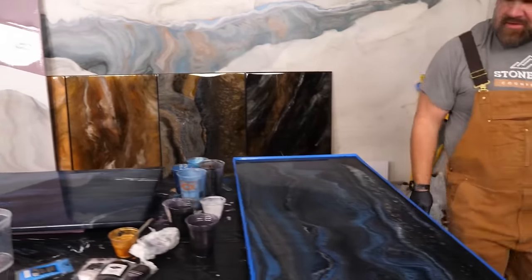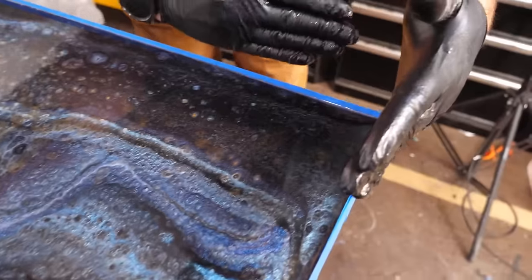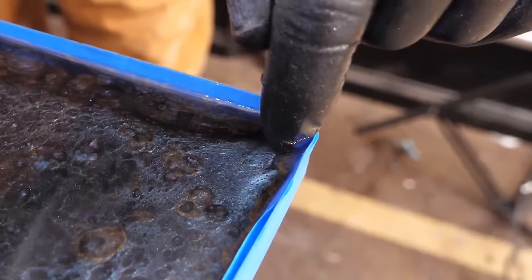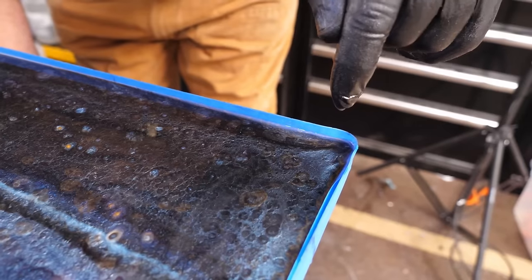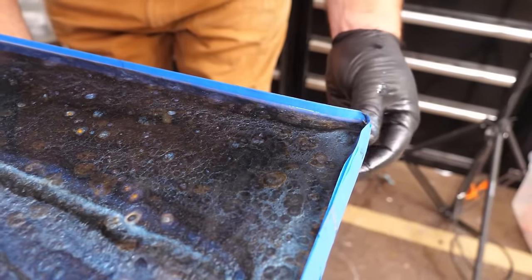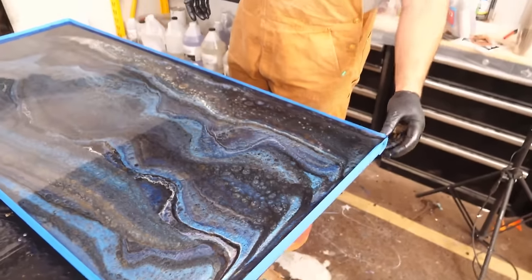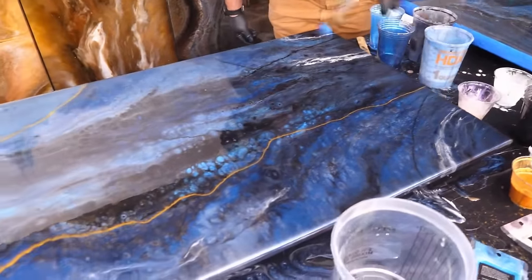This is not ready to pool yet, so I already know it's not going to look good. Come up here to the corner of your project, because all this epoxy on your corner — when you peel that tape down — is going to flow anyway, so if you mess up right here it's not going to show. I dip my finger in and peel up. If this epoxy stays on my finger and pulls up, it's still fluid. Even if I think I'm ready, if it drips off really quickly it's quite fluid still. I'll also push it and see how long it takes to self-level. Just keep checking — come back in an hour and it'll be thicker. Come back in two hours and you'll know you're good, and then you are off to the races.